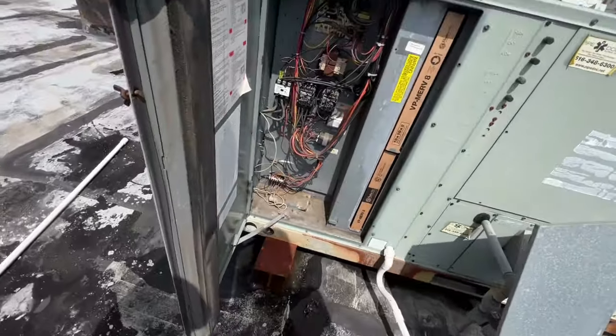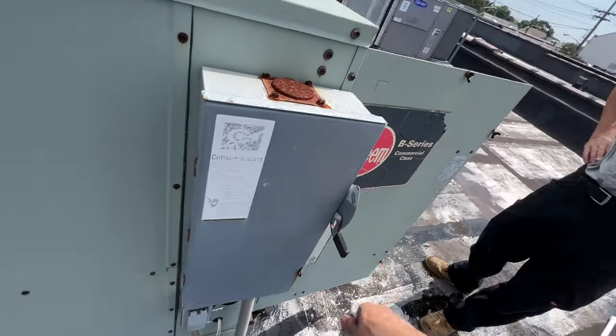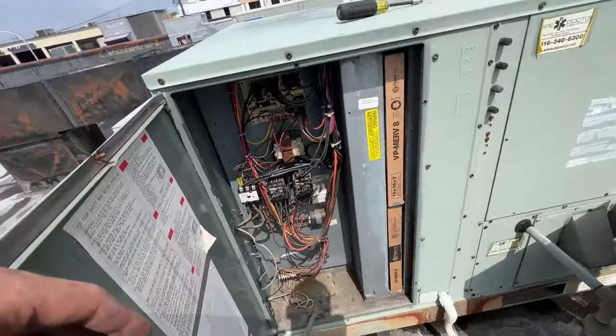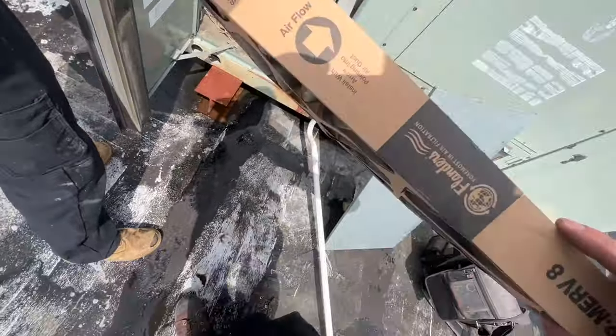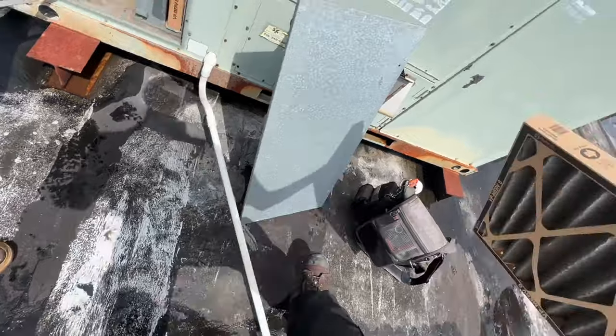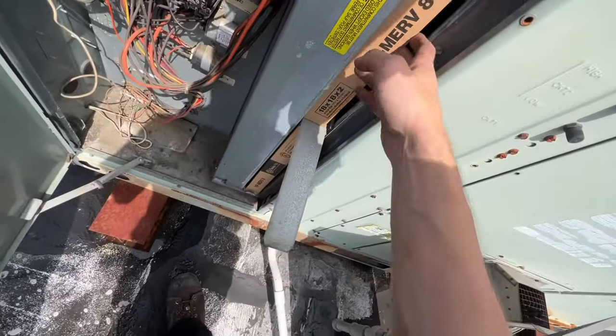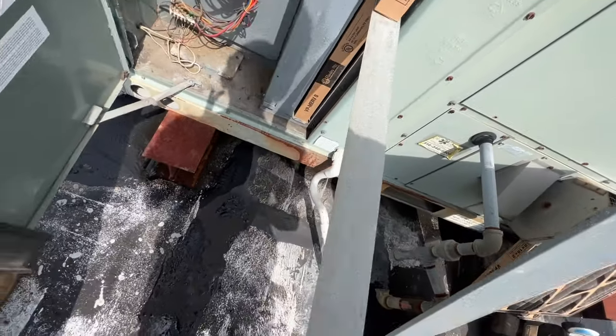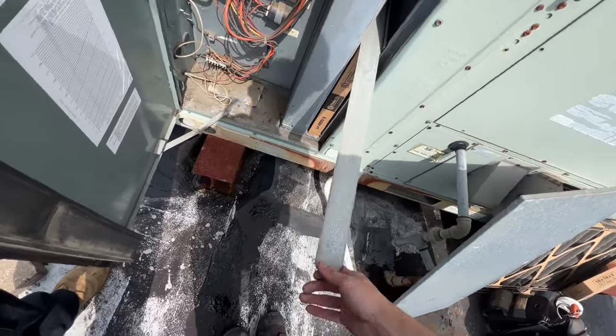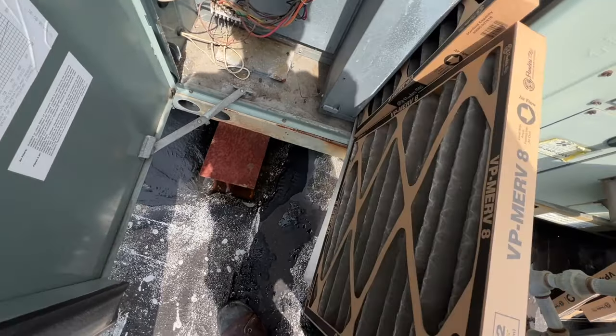It's an old rooftop unit — there's a history of them just wanting to add refrigerant every time. R22 system. We'll see what they want to do and what the issue actually is. Here's the unit — just took an overall look at a couple things. We're going to turn our disconnect off. We had no errors — the LED was on, just solid. Let's check our filters. They're dirty — holy crap, they're really dirty. Let's see if he has replacements. We'll run it filterless while we're here.